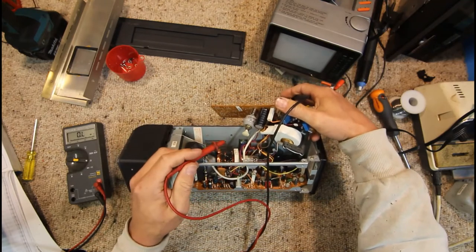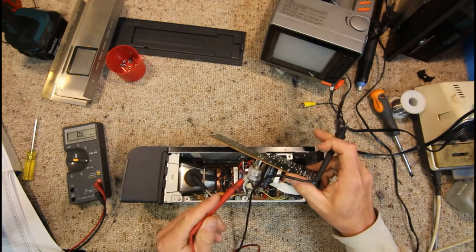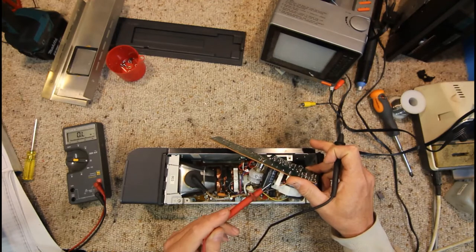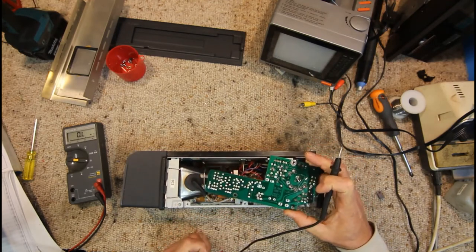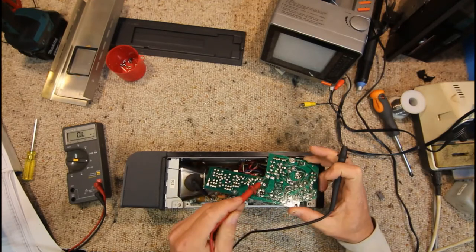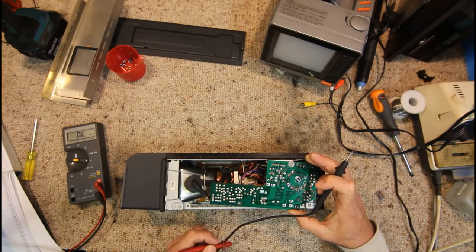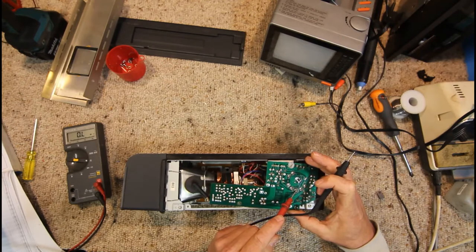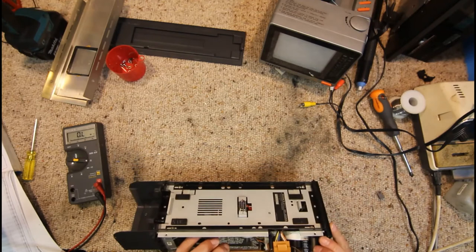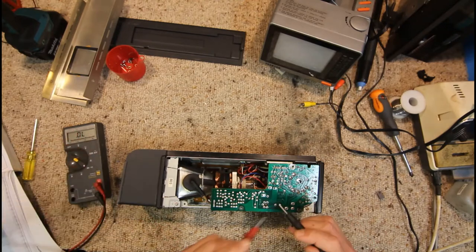With the connector back in on the horizontal stage we're reading 30 ohms — not a dead short, which is interesting. We'll move that from the camera and have a bit of a look around. It looks to be a horizontal output transistor — it's the only big transistor on that board. There's the yoke connector going through an inductor — maybe width or linearity — and a bipolar capacitor, which a lot of these little black-and-white TVs used, probably just as a DC isolator to the yoke.